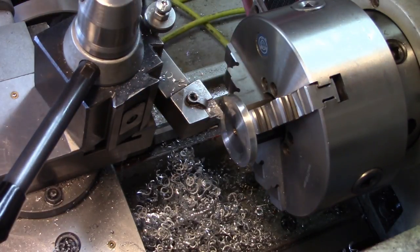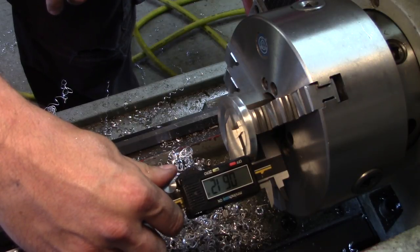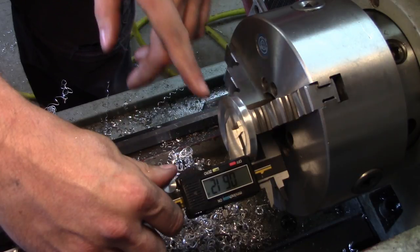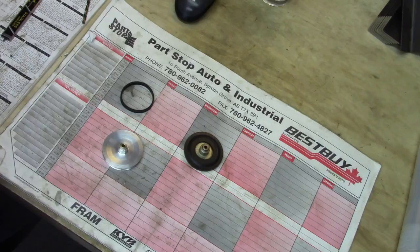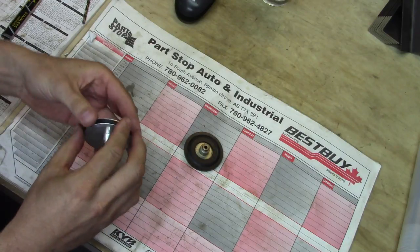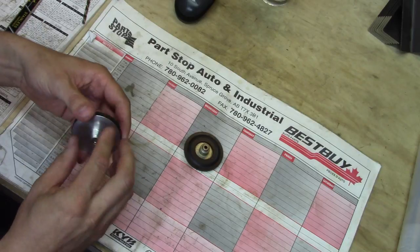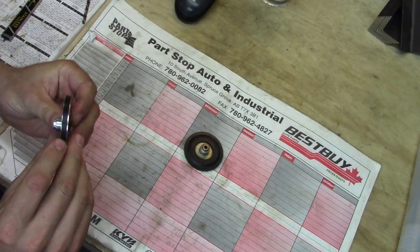Trying to take the chatter marks out, and that looks nice. As a final measurement, I needed to take 50 thousandths off of this side, and my 50 thou gauge block will actually fit in there, and I'm getting the same measurement as before I had taken the relief cut out of the center there. We have the correct depth. We're done. So we just take our flat O-ring - I've degreased everything, clean them up. Flat O-ring goes on, make sure it's seated in the groove, make sure the thickness is even all the way around. And yeah, there we go. Once again, thank you for watching, thanks for subscribing, thank you for all the likes and all the comments - all of you who are willing to join in and have a conversation, it's really fun to interact with you all. See you next time.